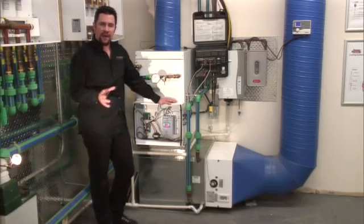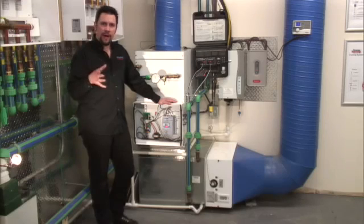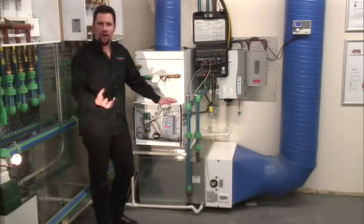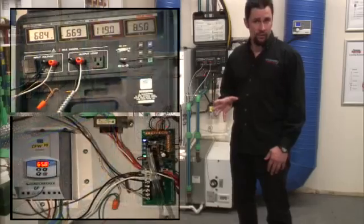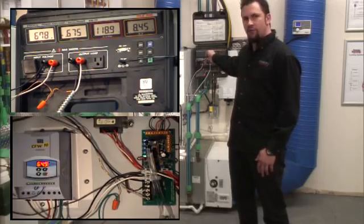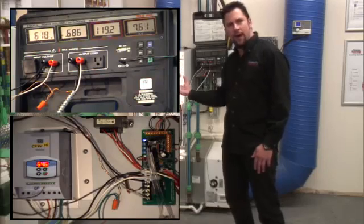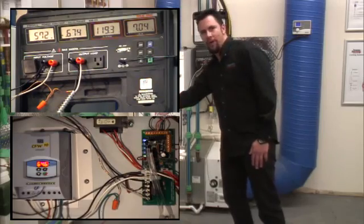What we are going to show you now is how the HEZ fan coil reacts in a zoning application. When a damper is to close, the static pressure in the duct is going to rise. My system is going to ramp the air down to maintain a constant static. Not only does it ramp the air down but it actually reduces the power draw on the unit which gives you true efficiency for zoning. We have just shut off one of the zones. As that damper starts slowly shutting down you will see not only is the power draw on the unit dropping, but also the frequency output to my motor is going to drop as it ramps the motor down to maintain that constant static pressure that is being controlled by the PSB board.